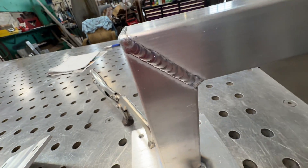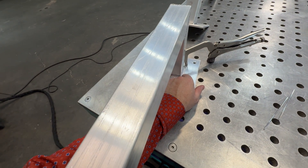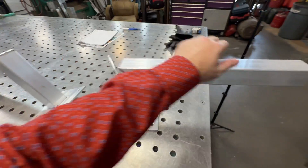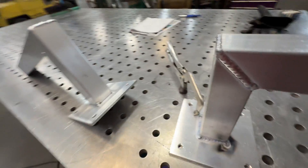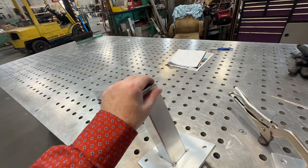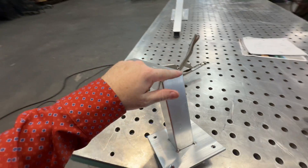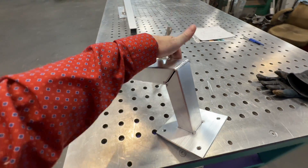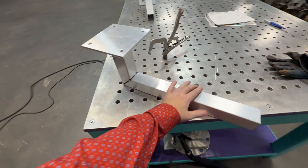You always want to make sure you wrap your corners — when I start I like to start kind of wrapped a little bit, go to here, and wrap your corners. You don't want to leave open corners; it makes it stronger and looks better. This one welded a little dirty — I didn't wire brush it; I probably should have even though I cleaned it. My gas was a little low so I had to turn it up. When I weld the top ones I like to weld the outside corner first — if anything will pull that way — then the two sides, then save that inside corner for last so it doesn't pull inward.